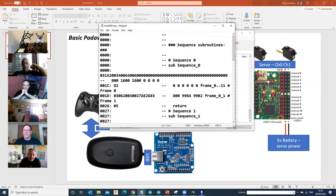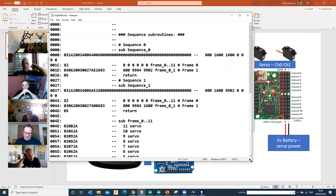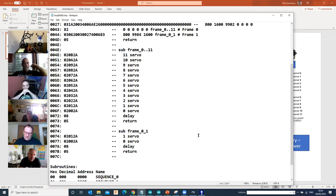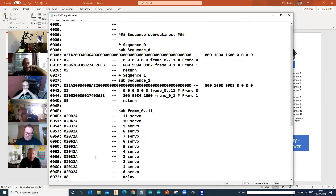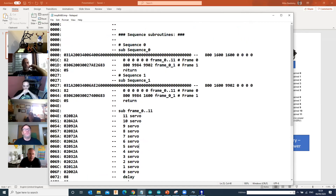At this stage the script sits here on the PC. When I hit Apply Settings, it loads all of that into the Maestro. If I click Run Script, you can see now it's working - that's actually running off the Maestro because you've loaded that code into it. At this stage that code exists in there, so now I can unplug the USB cable and that code will stand there as a standard load waiting for something to trigger sequence zero or sequence one. There's also a 'View compiled code' button that opens Notepad and shows you the actual code.